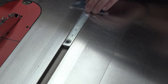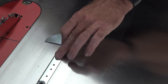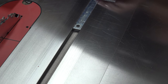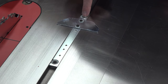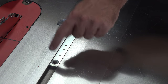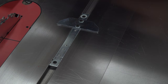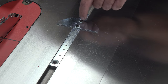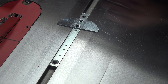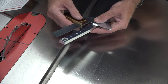For my liking, it's now sliding smoothly — no gap, no wiggling front or back — a nice clean tight fit. I'll also be removing these bolts and putting a little anti-seize compound on them, because over time that can be problematic. And even though this plate is squared at the factory, I'm going to put a square on it and verify it myself before moving on.